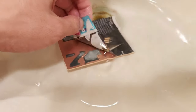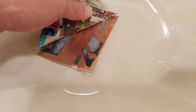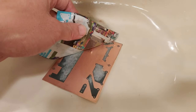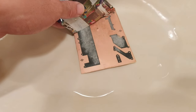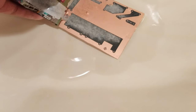I have this board sitting in warm water for a couple of minutes and, as you can see, it can be easily peeled off. But there's still a layer of white paper remaining — make sure you get rid of that. It's very easy. The next step we'll be looking at is the actual etching, but let me finish this and check if there are any imperfections on the transferred board.